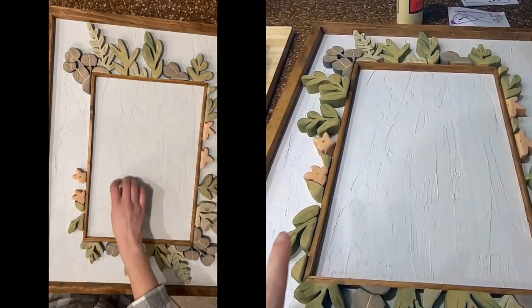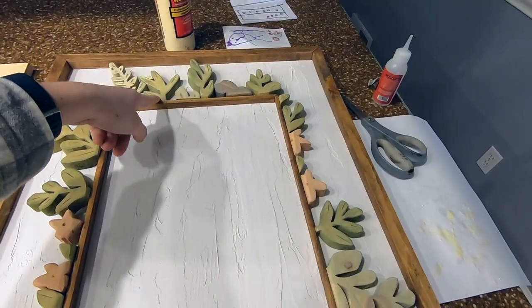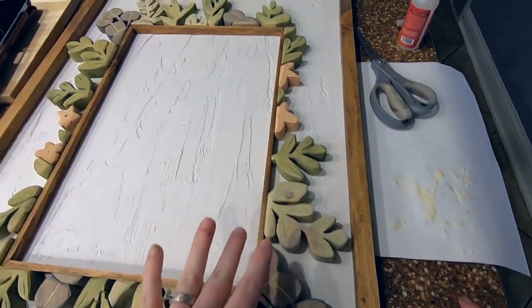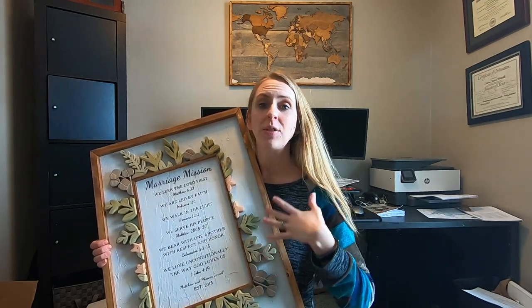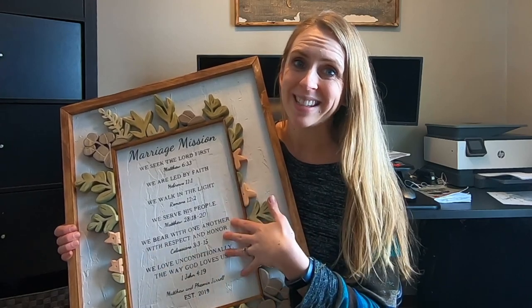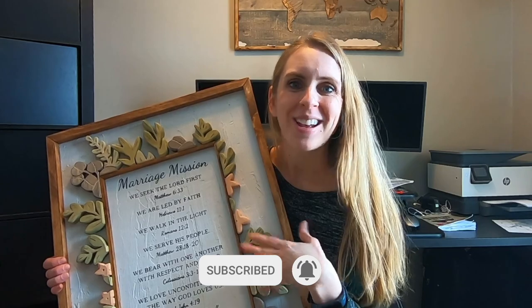I think I have these in the right spot. It's okay if you decide to rearrange a few pieces if you feel like they look better a different way. When you're doing the glue-up, I start with the wood glue, but I always dab it on a piece of paper first just to make sure there's not too much — you don't want it to squeeze out and stain your piece. Here we have the final project. After I finished with my glue-up, I gave everything a really good seal with some spray polyurethane. For the middle, I did all my words using my Cricut. I would love to see what you all decide to do with this space — please share it with me if you decide to scroll this. Hopefully this was helpful and I appreciate all your support. I'll see you next time. Happy scrolling!